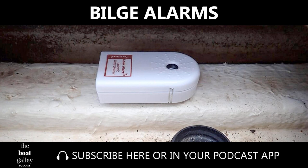And next, check the rate of flow. Our leak is nothing that is going to sink the boat — that much was immediately clear. After a full day of checking, we know lots of things that it's not. We've checked all the potentially big problem areas, and they're not problems. We've finally concluded that there was a tiny crack in a water hose where it went on a hose barb. We've fixed that, and we'll see if any more water appears. We're now checking the bilge every 30 minutes.